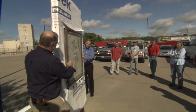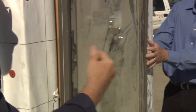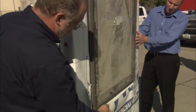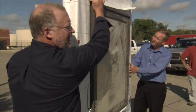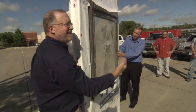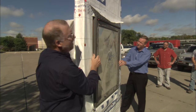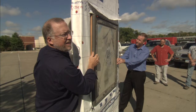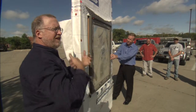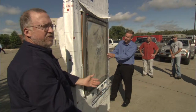These have a flexible flange, so the windows are really hard to keep in and out the same distance. You have to really pay attention to get this in the same distance so when you trim it, it looks right. But if somebody blows too much foam, especially on the top, it'll push that flange and then the window's out here like this. Then when you put your trim on, you're inside making all this custom extension jamb.